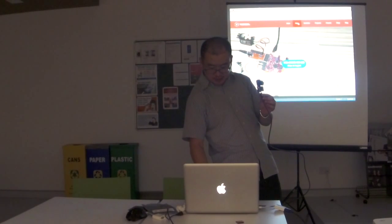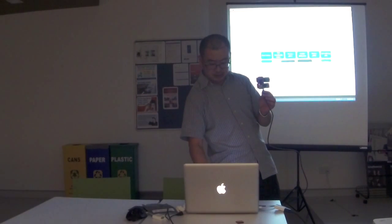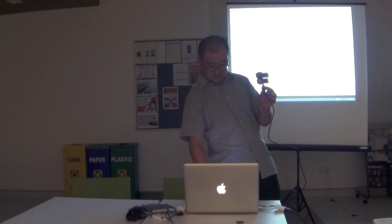Okay, so to install this, you can go to documents. It was all JavaScript code. So, technically, Node code, right? You're doing require blah. That's Node. So you write code in Node or JavaScript, and then it compiles it to Lua. And then it runs Lua JIT on the microcontroller itself, which then takes the Lua code and runs it.